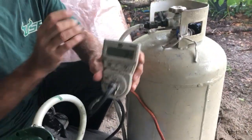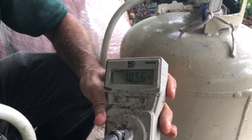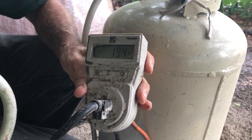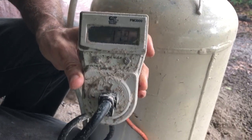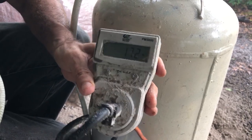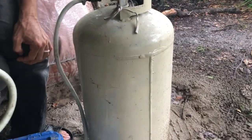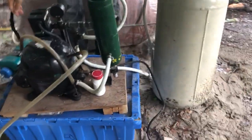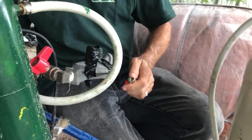When I turn it on, you'll see a spike in wattage. Turning on the pressure switch now — it went up to 1000, down to 460, then down to 194 watts. Its usual running wattage after the initial inductive spike is about 160, so it'll settle into that. That means we are now compressing biogas from this storage bag.